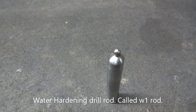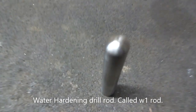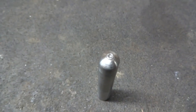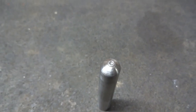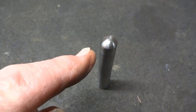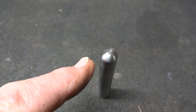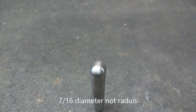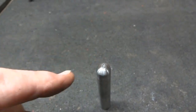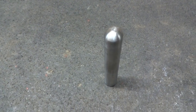This is my new pin punch. On top of it we have a 3/16 ball sitting there so you can see the need for it. There's a little indentation at the end made with a center drill. This is a 7/16 piece of drill rod, and I've put a radius on the end — a 7/16 radius — which is fairly true because I used a radius tool to do that.